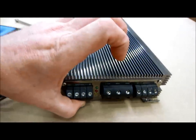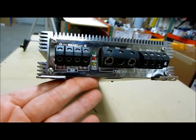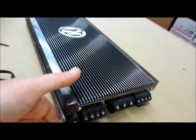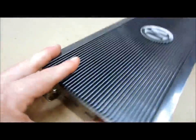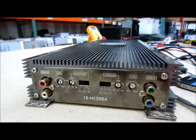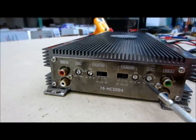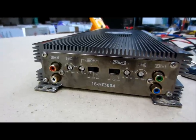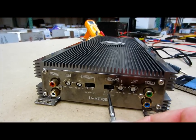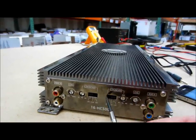On mine I have machine thread screws which I'm not going to open up — I'm just doing a quick test. These have a little bit of space so I can just jam my wires in tentatively to get my connections made. On the other side I have a pair of RCAs for my front and rear channels. Over here I have my level settings which I'll use a small slot head screwdriver for, as well as my crossover — this 4-channel can do low pass filter, no crossover, or high pass filter. I'm going to check all three of those settings on both sides.